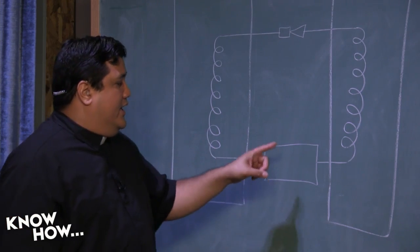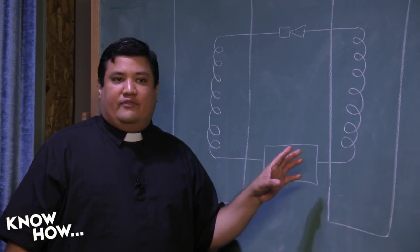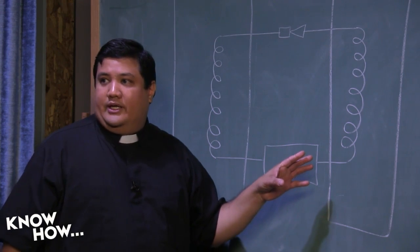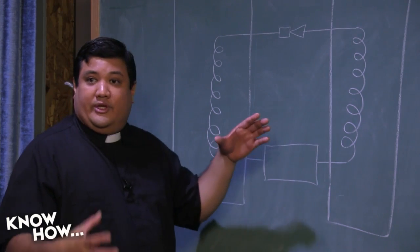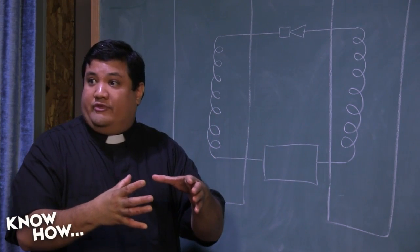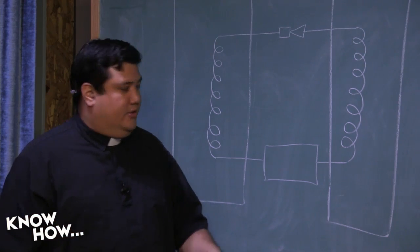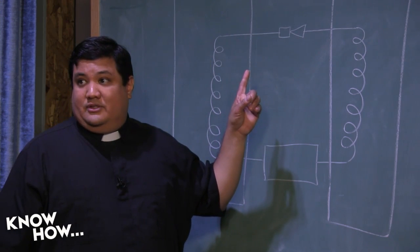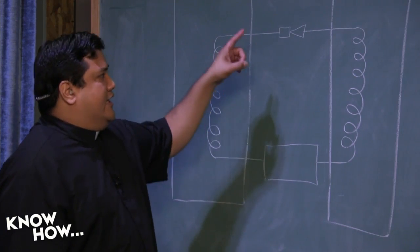So for example, let's say I have gas at 50 degrees. Now I'm going to compress it so it's in half of its original volume. It's now 100 degrees. I run it through this coil so it gets back down to 50 degrees. And then as you let it expand, it'll drop to 25 degrees. Now I've got that ultra cold air.